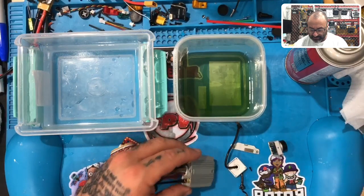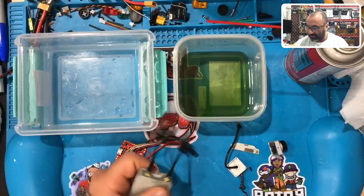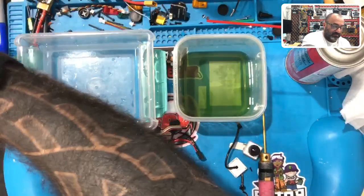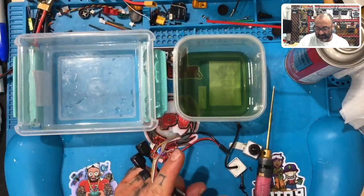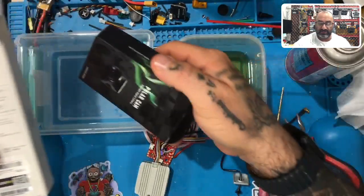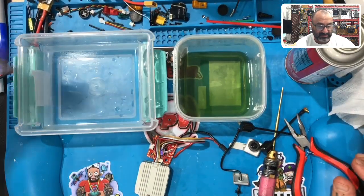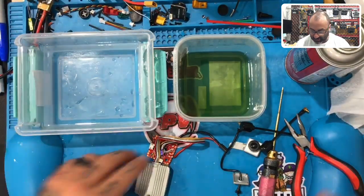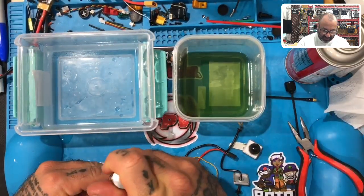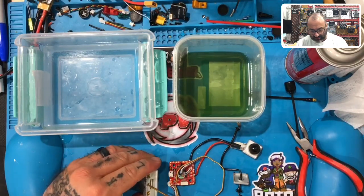For the air unit, I'd suggest taking the antennas off — you'll want to spray everything, and you want to do it after you're done soldering. These brand new antennas can be tricky to get off when your hands are slippery. You'll want to remove the screws on the top and, if you want to go more in depth, the smaller screws inside too to separate the whole thing.